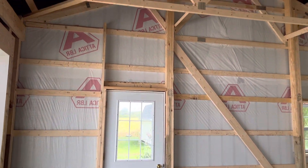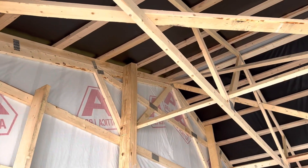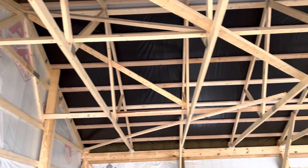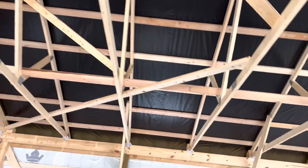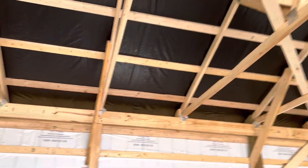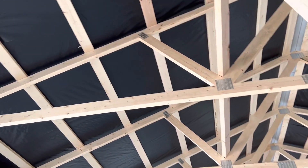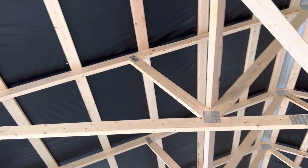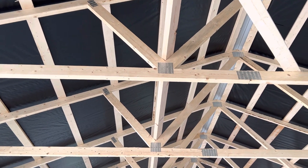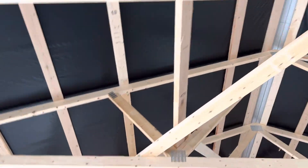We do our trusses — again, a 24 by 36. These trusses have a 2 by 4 bottom cord and 2 by 4 top cord, and we space them 4 foot on center. I've talked about this in the past — we're not an 8, 9, 10, 11, or 12 foot on-center company. We put our trusses 4 foot on center. You can see how these purlins are laying flat — it's not a tall building at 10 feet. If you put them 8 or 9 foot on center, you'd have to go on edge with your purlins. We put purlins flat, which makes for easier application.